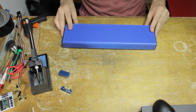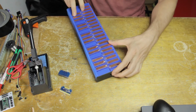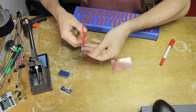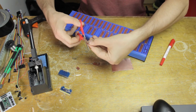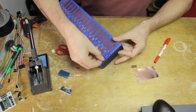But there's actually one thing that I almost forgot, and that's I need to apply 2 more sensors here, which are going to be for pitchbend. And that's one of the cool things about the C board. You can use capacitive sensors just like the keys to make pitchbend sensors, and that's what I'm going to do right now. You'll see how those work in the end when I play the instrument, but for now we just need 2 more sensors on here.